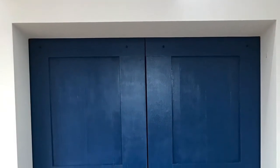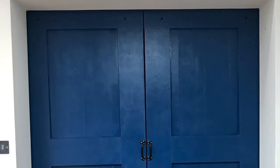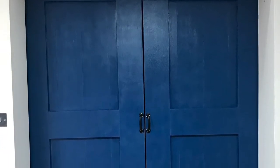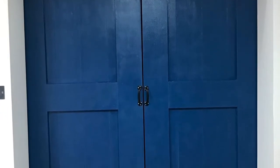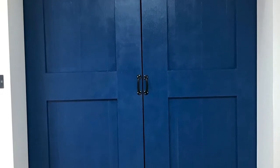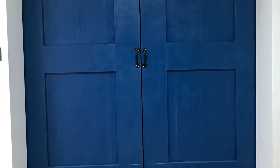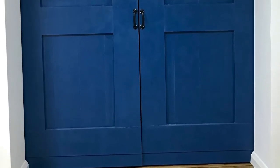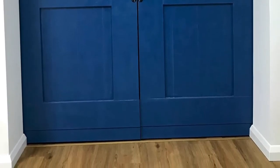So that's the doors all finished, painted blue. You've got to put down a sealant over the knots prior to painting — use the correct products and take advice on that. You then also need to put on your handles; just make sure they're small enough that they're not going to bang into the walls when you open the doors fully. You can adjust the door stoppers or final springs to make sure that doesn't happen.